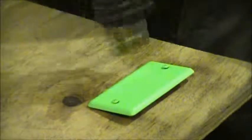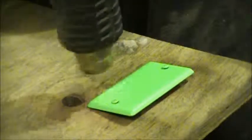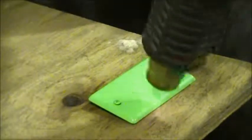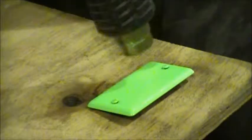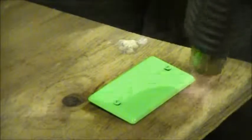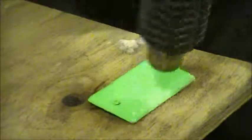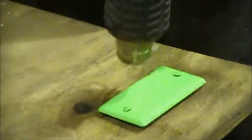Once you're confident that you've got all the water out and it's dehydrated properly, bring the heat in and go ahead and bring your powder into gel state. Maintain gel state. You can watch the heat pocket move — you're actually going to move the heat pocket to bring the entire section you're working on into gel state. You'll see it become real shiny. That's the powder that's cured — that's in the curing process.